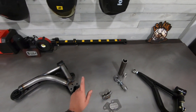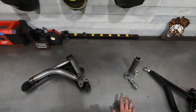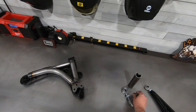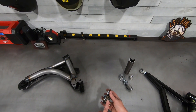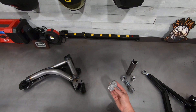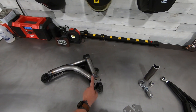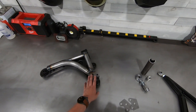Let me dive a little more into the construction. Every single piece of this arm is custom made — with the exception of the rod end, even our tube inserts are custom. The ball joint clevis is no exception. We have 3/16 plates top and bottom that have been precision machined, with a tube insert with locators for the ball joint clevis. This ensures that every single time one of these gets welded together, you get the same exact precise location of the factory ball joint with slightly improved geometry.